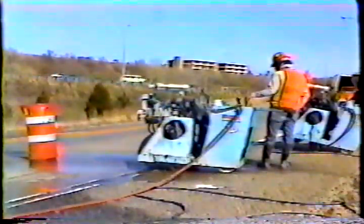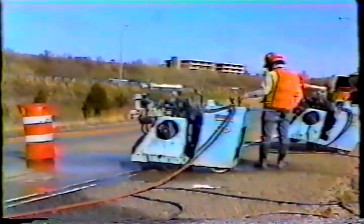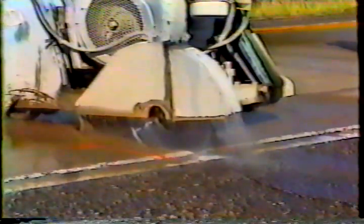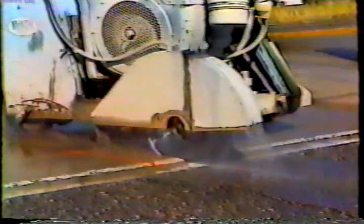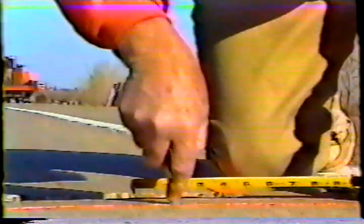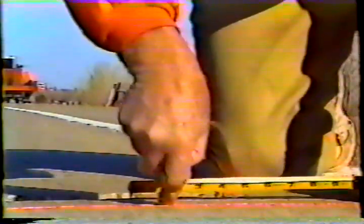And that brings us to the next step of spall repair, cutting along the marked area with a concrete saw. The maximum depth for a spall repair along the joint is 4 inches. There's not enough pavement left below 4 inches to ensure a good patch. There's also a minimum distance. Cut at least 1.5 inches into the spall. A patch less than 1.5 inches won't hold. Measure the cut if you have any doubt about how far down you've gone.